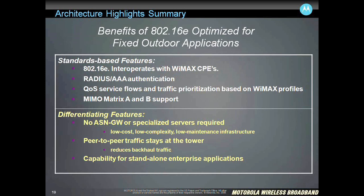To summarize on the architecture: this is an 802.16E standards-based platform for the 3.65 GHz spectrum, optimized for fixed outdoor applications. We've been deploying this product since the beginning of the year. We literally have hundreds of customers and thousands of subscriber modules and access points deployed, so this has now been a proven solution. The standards-based features include 802.16E, AAA and RADIUS authentication, standards-based QoS service flows, and traffic prioritization — so you can mix and match best effort internet services, voice services, video, or T1/E1 replacement type services. We support MIMO matrix A and matrix B. We've stripped out everything related to mobility, including the ASN gateway, and focused very specifically on fixed applications.